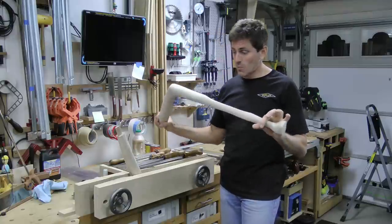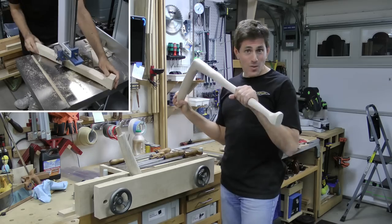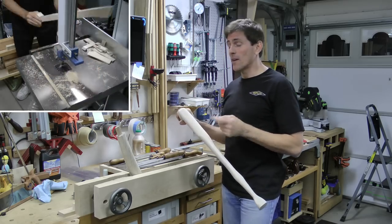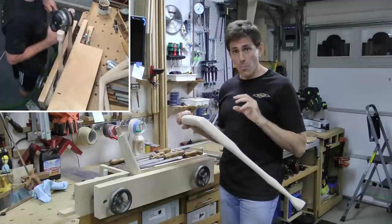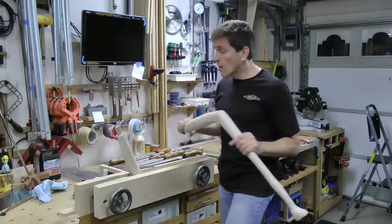Now, of course, once you get to this point, me being kind of more hybrid as opposed to only hand tools, I used this model to be able to do some faster shaping on the other forelegs by running it through a bandsaw and then using a grinder to take off some of the big bulk before finessing with the six through the 15 grain rasps.